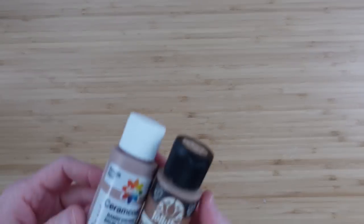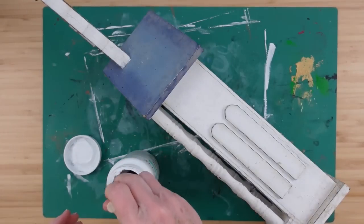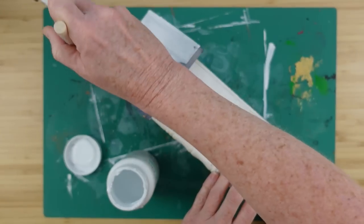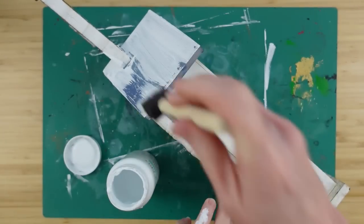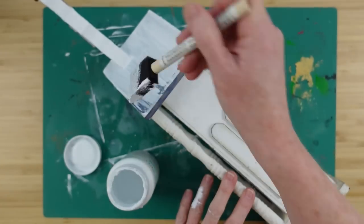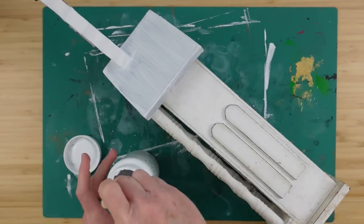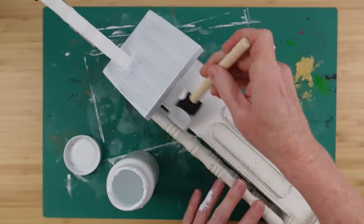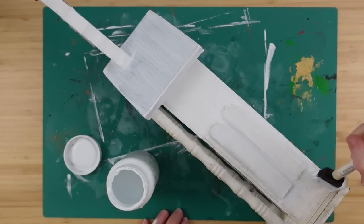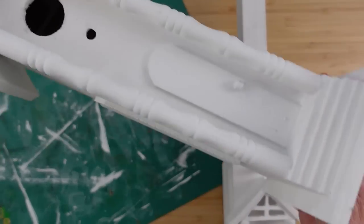The little bell is stuck in the top too. Now I'm going to use two different color browns — a latte brown and Bambi brown. I'm starting off by putting down one layer of chalk paint so that everything will be somewhat hidden and one color. All the blue stuff and stains will be covered in white, and hopefully it will block some of those stains. I did two coats on the water mark areas, but I'm going to do the whole thing — front, back, bottom, all of it.